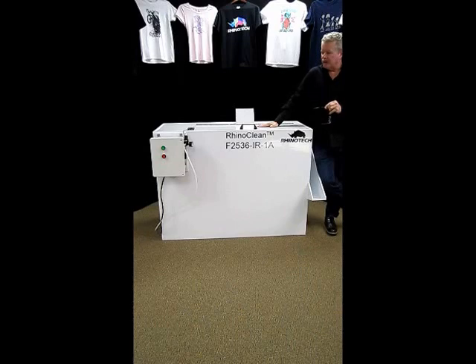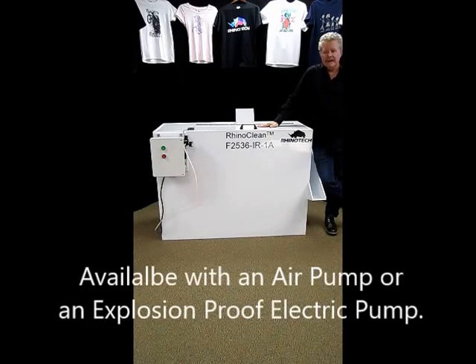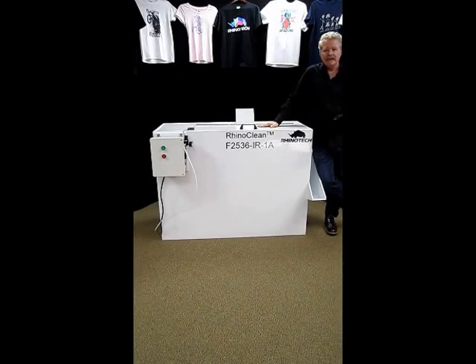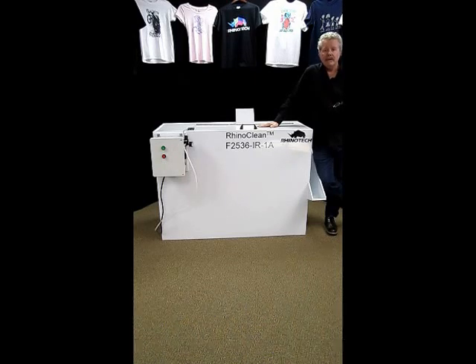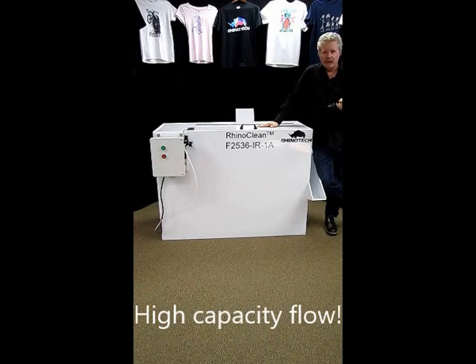This particular unit is set up with an air pump, which is advantageous in some situations, or with an electric pump — an explosion-proof electric pump. I particularly like the electric, because in that case we can do two screens up at a time. We have more flow, about 20 to 22 gallons per minute of fluid being passed through the unit. So it's not a high-pressure cleaning for ink removal, but it actually just floods it dramatically so that it dissolves all of the ink.